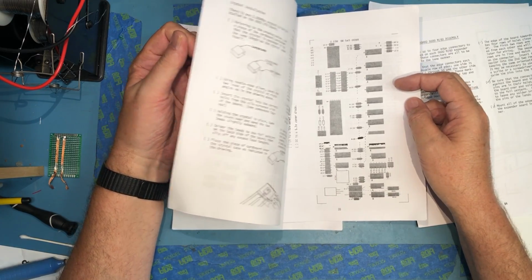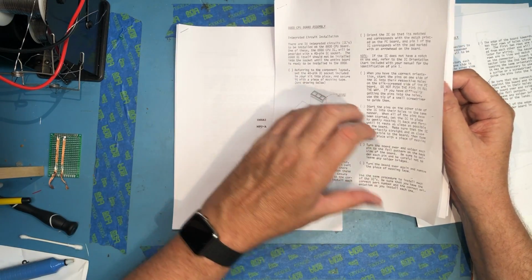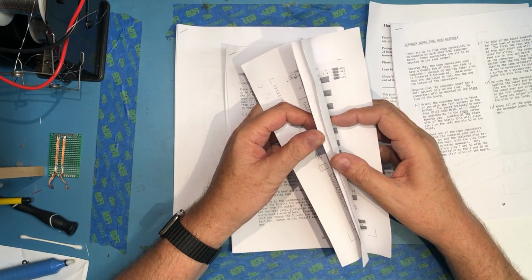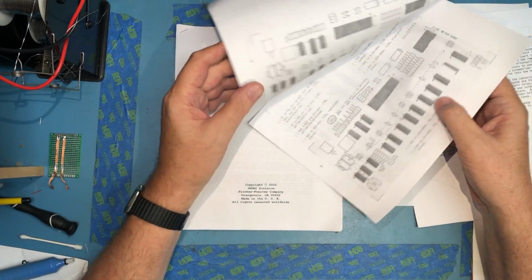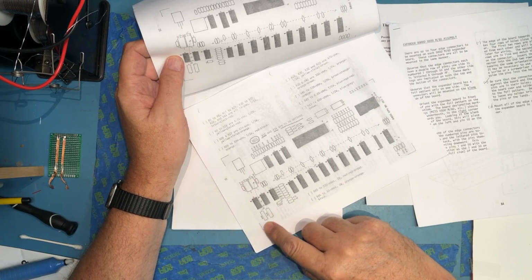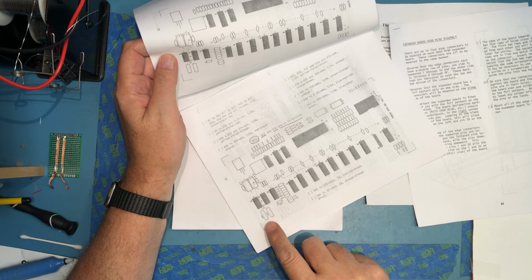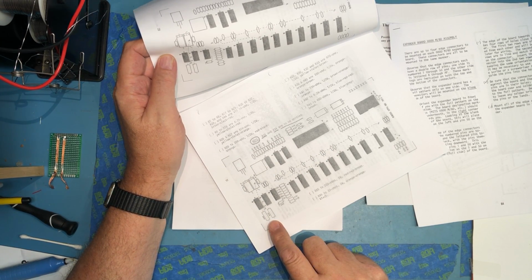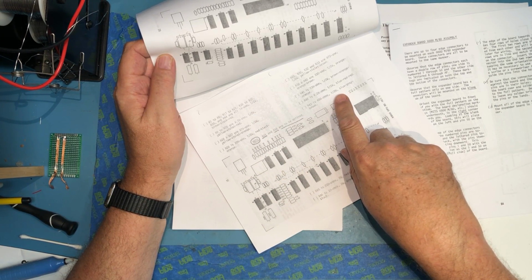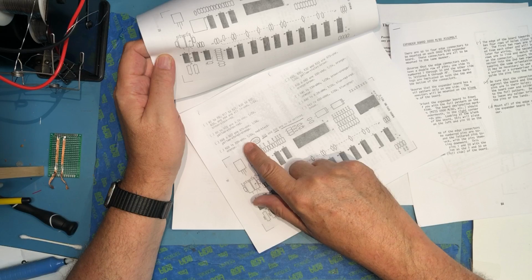The really old school assembly books. You know, these boards are close enough reproductions that they actually use the original documentation for assembly. I guess I can produce a BOM from this. It's giving resistor values and numbers. That looks like R45 and R46. This had me curious last night, because in the photographs these are like half watt. These are all labeled to be half watt. Maybe they were larger than half watt. I won't be using full half watt resistors where I don't have to.